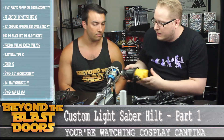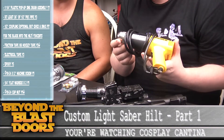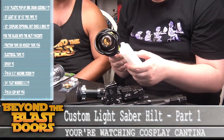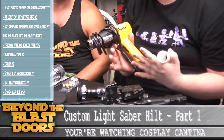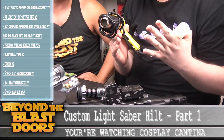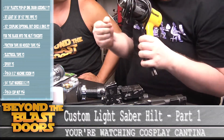Some various tools of the trade. We have a heat gun — you've got to be careful with these, they get super hot. This one can get up to a thousand degrees. It's used to carefully heat up plastic, allowing you to shape it a little bit. This one has a low and high setting — I got it from Walmart for $19.99. I generally use it just on low because you don't need the highest setting. It's great for shaping things like PVC pipe, flexing or bending it. If you made a bend too large, just heat it up a little and shape it to what you need.